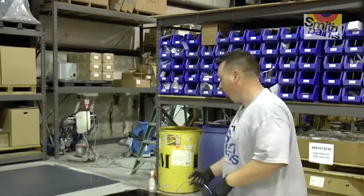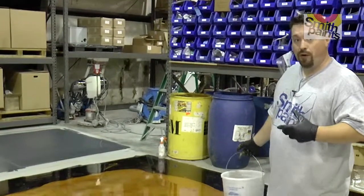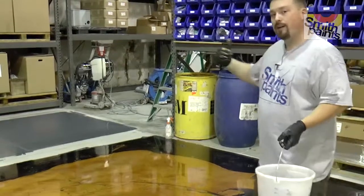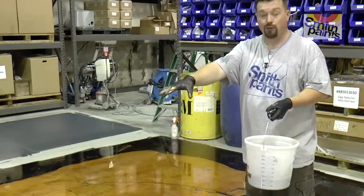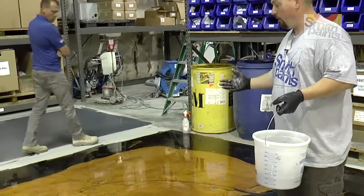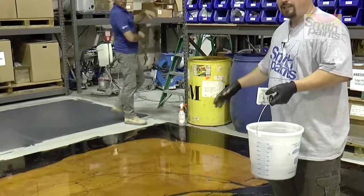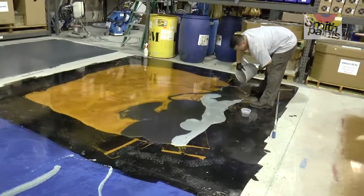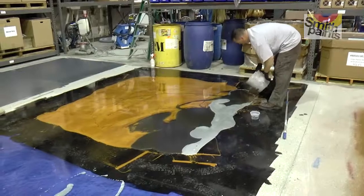You can't do that with epoxy because if you hit it, it'll relax out — it sits there open longer. So you're going to break your tension with it first, wait about 30 minutes, sometimes 45 — really temperature dependent — and then you're going to come back. If you want to create those ringlets you're going to have to spray it again because they'll go away. Let it settle; once it relaxes, then you come back and do it. It's more to flatten it out and get rid of some of the tension created from the air from moving it around.